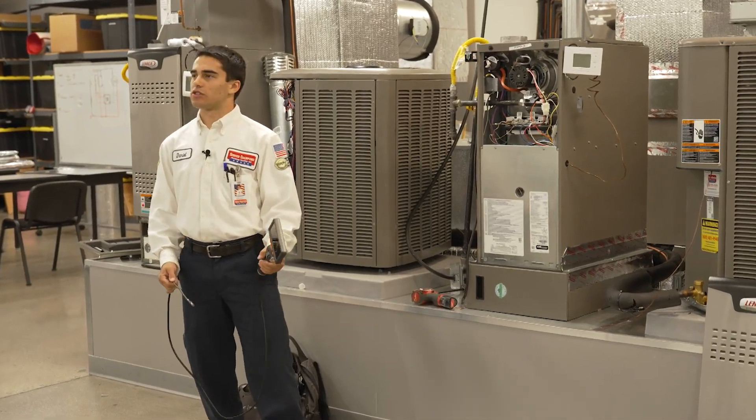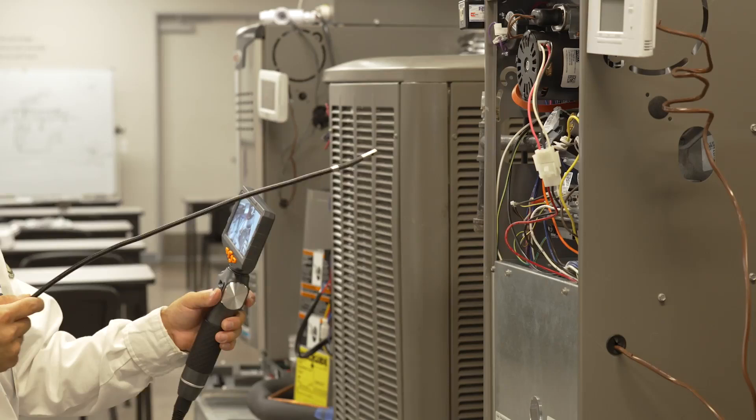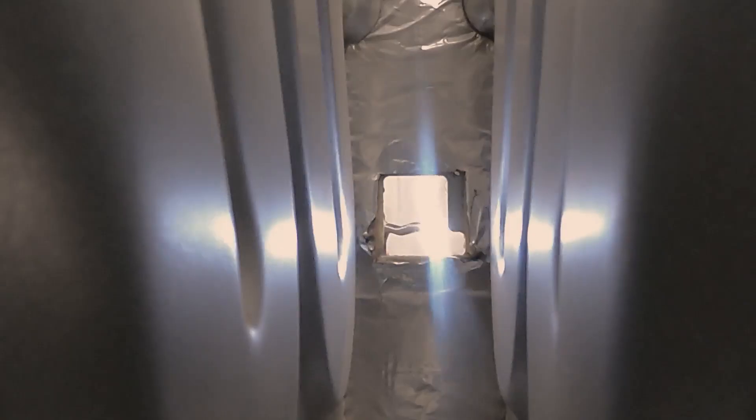This is where we inspect the heat exchanger to make sure that your furnace is operating safely for the winter. We're going in through the high limit switch that we've removed, which gives us access to the heat exchanger. Inside, we're looking at two of the chambers, looking for temperature stress points — any places where the metal has become discolored. Those right there are your rivets, a common failure point, so we're inspecting to make sure we don't have any kind of separations.